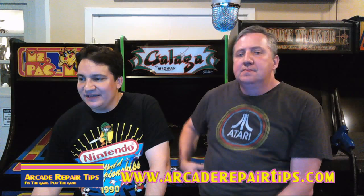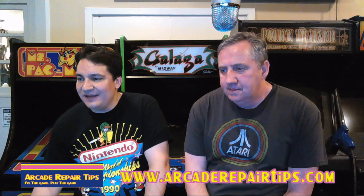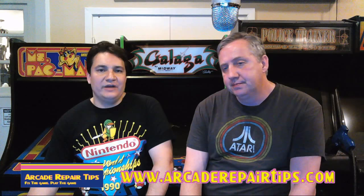Austin says, how do I get the 60 hertz hum out of my machine? A lot of times, Austin, if you've got a lot of hum in your machine, it's a grounding issue of some sort. It could be that you don't have your game properly grounded to your outlet. It could be that there's not proper grounding from your board to a ground area in your cabinet. It's usually a grounding issue. More than likely. Or you could have some bad audio caps, or a speaker could have that as well. Or an audio amplifier issue, if you have an audio amp in your game. It could be several things.